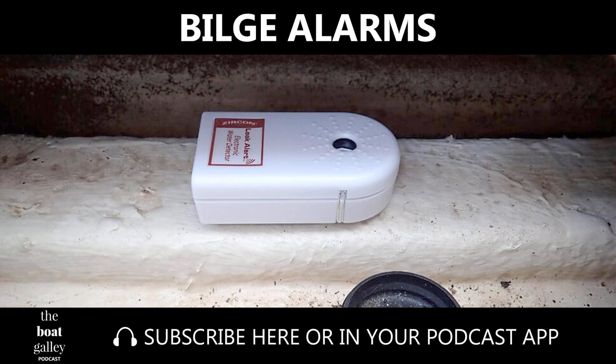We opted for a hot water heater alarm that runs on a 9-volt battery. It's not as loud as some, but it's still loud enough that we can hear it over the diesel engine. In an emergency, we can silence it by drying out the contacts or just pulling the battery. While we like having an alarm tell us of a problem, we don't want one constantly sounding as we are troubleshooting. The company says one battery will last up to five years and the alarm will sound for three days if activated. Just to be on the safe side, we use a lithium 9-volt battery and replace it every year on our anniversary. The old one gets put into a blood pressure cuff where we'll see if it dies — I want to know that the battery in the bilge alarm will work.